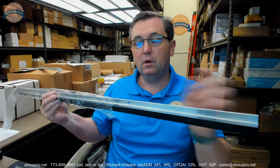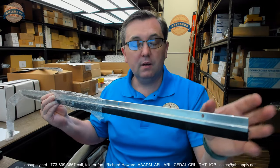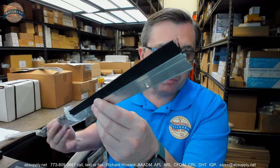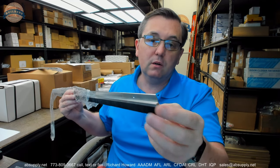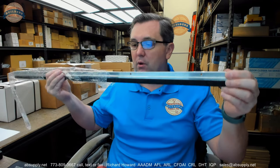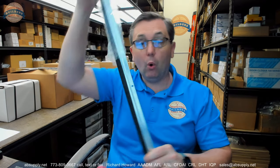This happens to be a three-foot piece. You have a slotted hole here, another one here — they're basically equidistant from each other and symmetrical from the end. If you have need for a custom length, by all means let us know by ordering the next longest piece and simply indicate in the comment field the net length you'd like us to cut the material back to. It'll save you the trouble of cutting aluminum and steel, as well as drilling a new slotted hole. The slotted hole is there to help you contend with a sill that's not level, or a door that's not plumb.